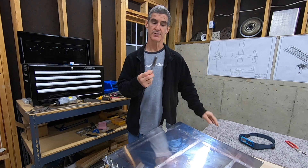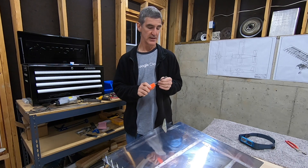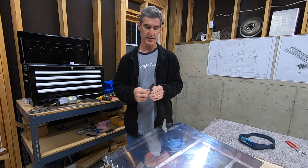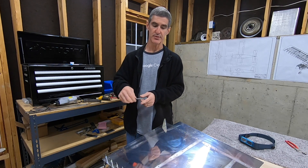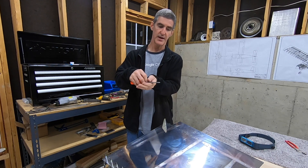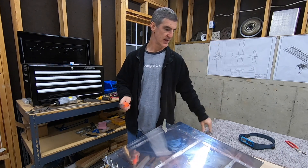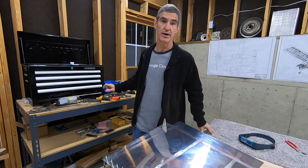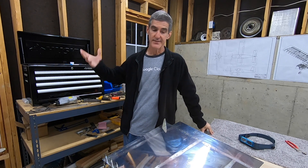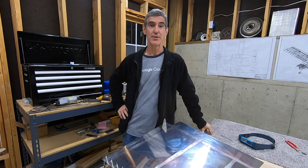What I ended up doing was sacrificing a chisel — this is now an airplane tool. I ground the end of the chisel off so it wouldn't scrape anything up, then was able to put that up under there with another piece of metal as a fulcrum, the whole thing sitting on the back rivet plate, and then bucked against the chisel right there. It was still kind of clunky but it did enable me to set the rivet the rest of the way.